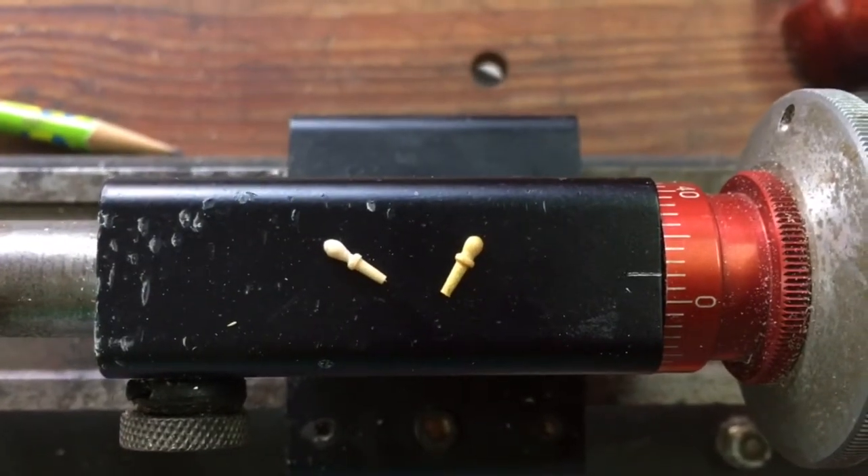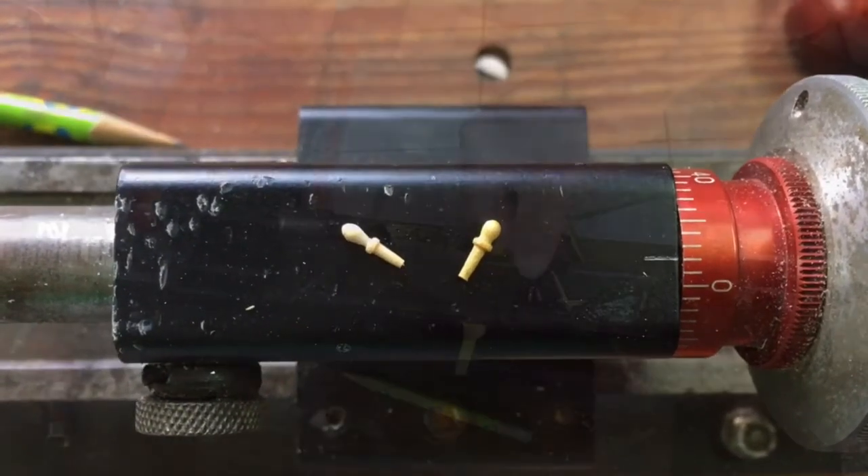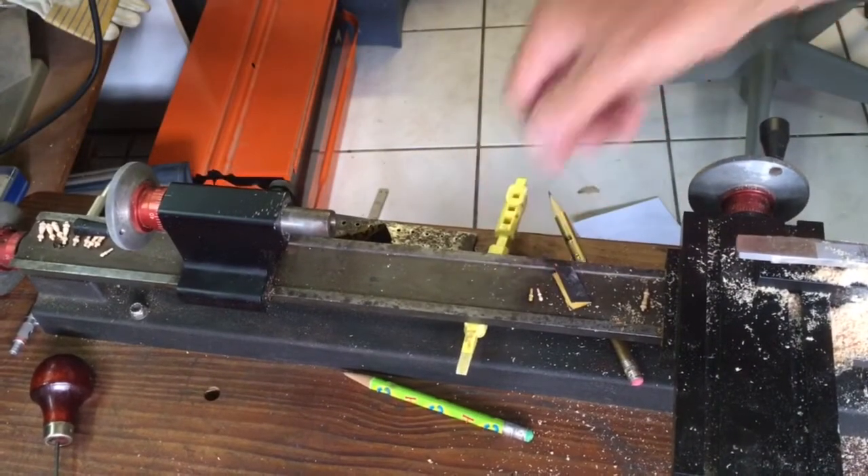The one on the left is the one I made; the one on the right is the kit-supplied one. I think mine is actually better than the one supplied by the shop. All in all, I'm very, very satisfied. There's really nothing that I can't make now using the lathe. The key to the whole thing is having a very dense, tightly grained wood — the hardest wood that you can get — to make these fine parts. And again, start on the outside and work toward the inside. I hope you've enjoyed this little video as much as I have, and I'll see you in the next one. Thank you.